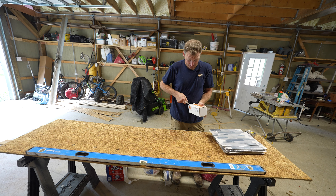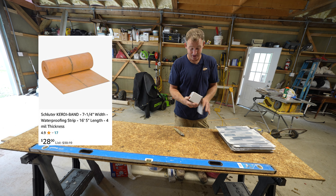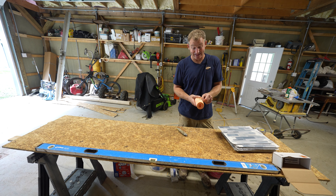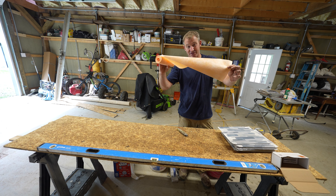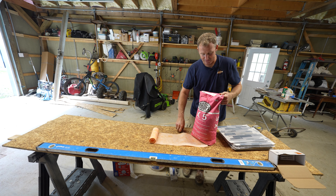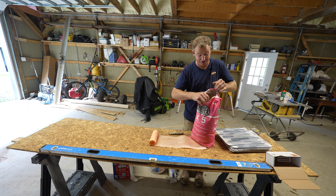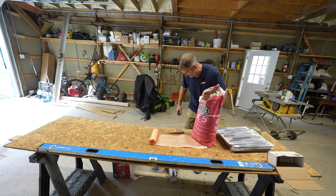But this will save a lot of time and headache with installing the border and making sure that you set it at the correct depth — the same depth as the wall tile. It's just a sheet membrane. We're going to use some ARDEX X5 for the thin set, and I'm doing this the night before so that everything is nice and well bonded, and then I can go ahead and put this in.